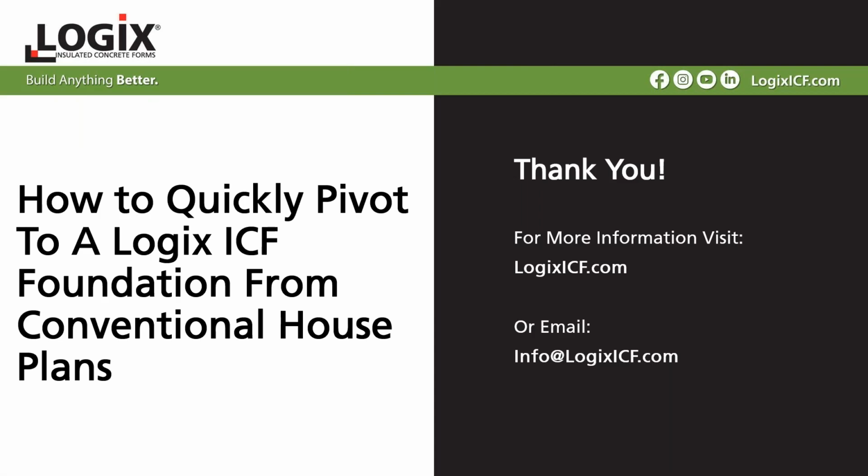Okay, so that was a quick intro into converting a conventional foundation to Logix. Hopefully that gave you a better idea of how to go about the conversion process, what to consider, and what we can do for you at your end. One thing that I didn't mention is that when we do the conversion, we're converting everything that is required to be converted. So if you're converting your foundation plan, we're not just converting the walls, we're converting the connection details to that wall, so the floor, etc. We'll make sure that all the elevations are changed and point out any conflicts that you might have with the design or on site, so your designer can make adjustments at their end as well.